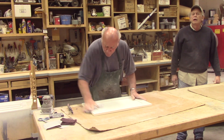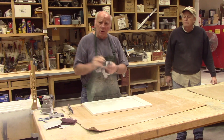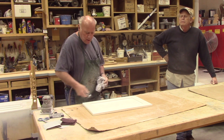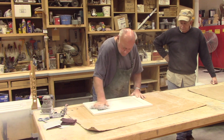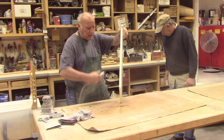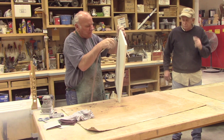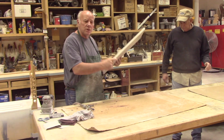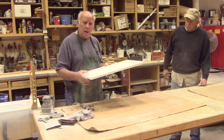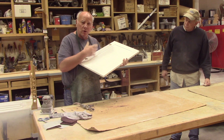I'm putting a moderate amount of pressure when I wipe this off. You see I'm constantly — you know when you wax and you're wiping wax off and you constantly turn the rag to keep picking up the wax? You're basically doing the same thing with these rags. Now this is ready to go in the spray booth — one last shot with the air hose. It'll sit on those nail boards. Right before I spray, we set them down face up, give them one final light wiping and blow off, then turn them over and do the same thing on the back, then we start spraying.